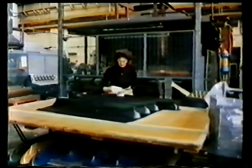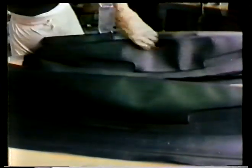Vacuum forming can be a sophisticated but inexpensive process for making a wide range of goods, from chocolate boxes to the insides of refrigerators, from small boat hulls to photographic developing dishes. The molds or forms used in the process can be made from a wide range of materials, including wood or aluminium, and can therefore be relatively inexpensive. This sheet has to be stretched initially, and this is done by blowing it up with pressurized air. This enables the sheet to spread more evenly over the form when the vacuum is applied.